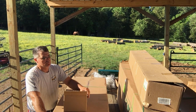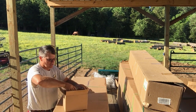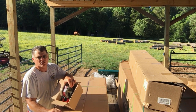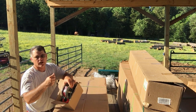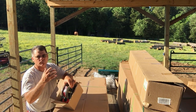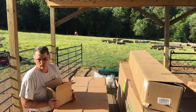Rooster, take a break. And when I was reading about this kit from Woodland Mills, they said that they used the synthetic rope instead of a wire cable. I said they knew what they were doing, because that cable starts to fray if you've ever used a winch. You'd always have to use gloves to work with it, and then the little wires break, and you get one jabbed in your hand. And I said, this is well worth the money here. So check out the ramp kit when you go to order your sawmill.